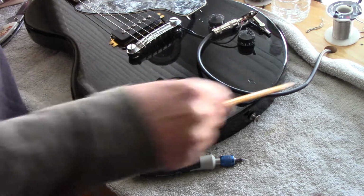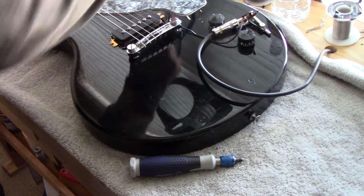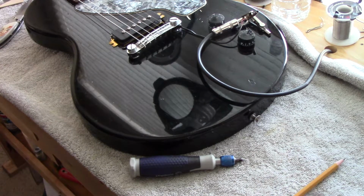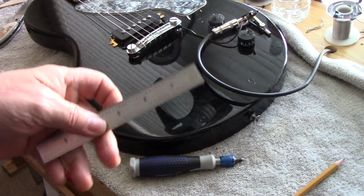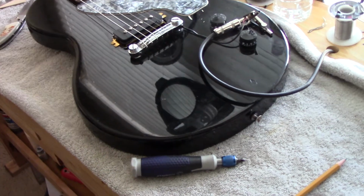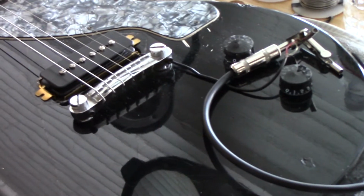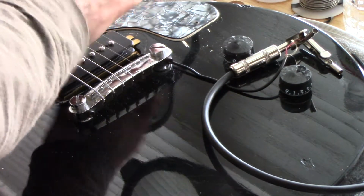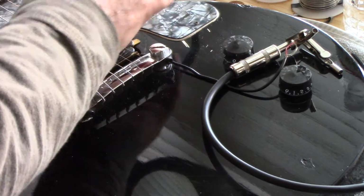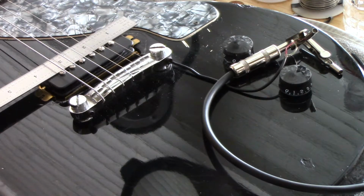Okay, so now what we've done is we've used a couple of alligator clips to connect the pickup to a guitar cord that's running down under the table to a little pig nose amp. Not the best, but you'll get the idea. What we've got is our ruler once again, and I'm going to zoom in so we don't need to look at anything but what we're doing. Now if you listen, kind of chinny. I'm going to place that ruler again and disrupt that eddy field.